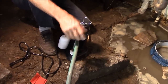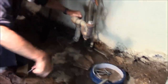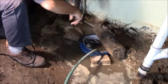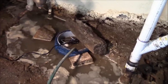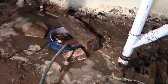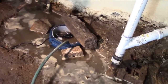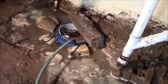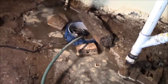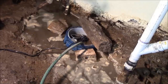Our pump is running, our garden hose is running out. What could possibly happen here is when this pump pumps this bucket dry, the bucket may try to float. I'll throw this hunk of concrete on top so I can still see the pump and I'm not interfering with the float. Our filter and bucket with all those holes is letting enough water in that we're not evacuating the bucket in 10 seconds. The pump would also be a lot happier pumping through an inch-and-a-half discharge line instead of just through a garden hose.